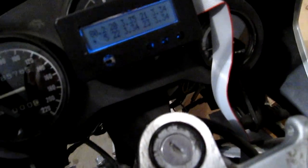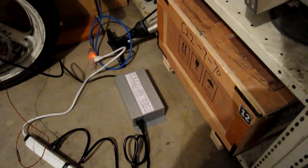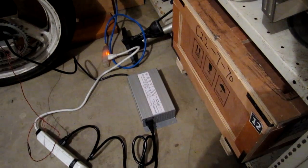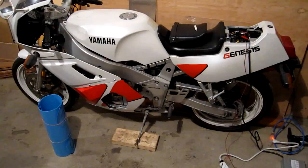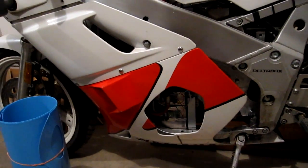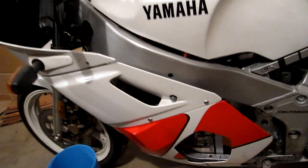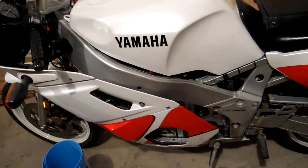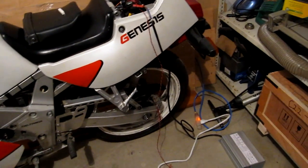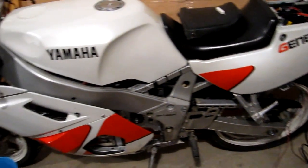I changed the upper voltage limit to 3.4 volts per cell while I was off camera, so the BMS didn't get a chance to trip. The regulators are set at 3.35 still from last time, pretty conservative, and they're just starting to shut off now. Anyway, the next video I make will probably be the bike running, so I'm pretty pumped for that. I'll definitely update things more when I get those sprockets in. See you next time!